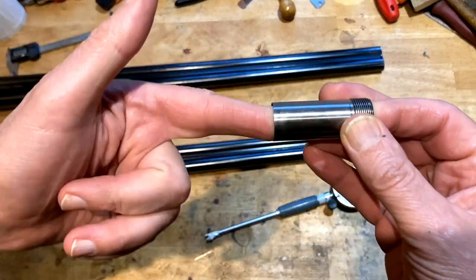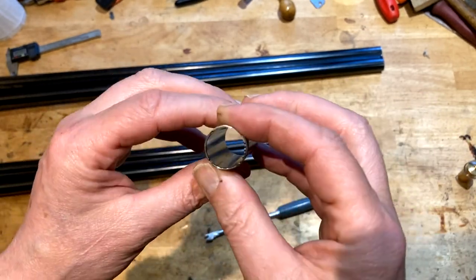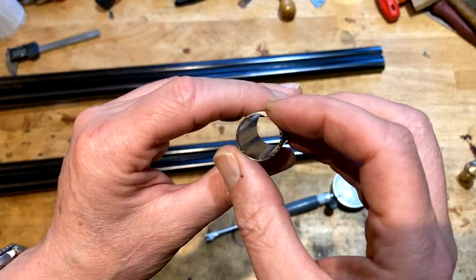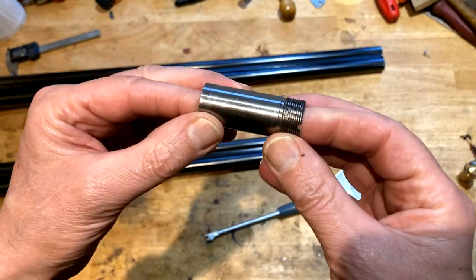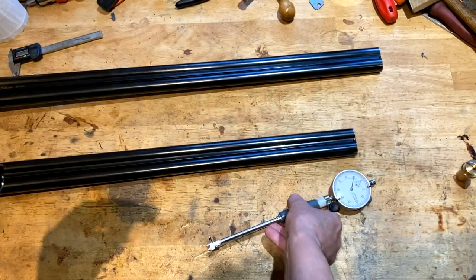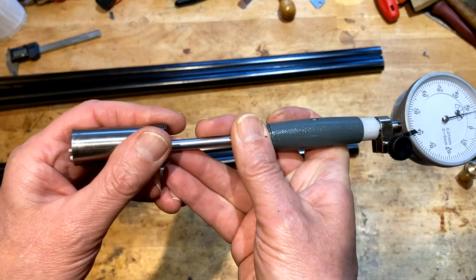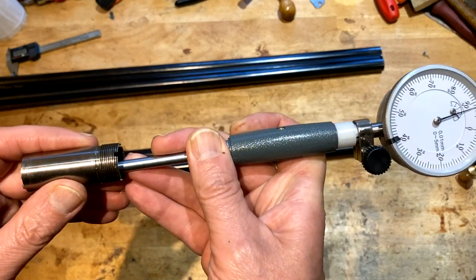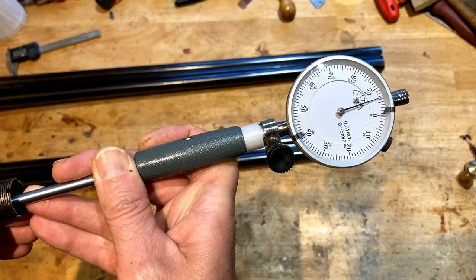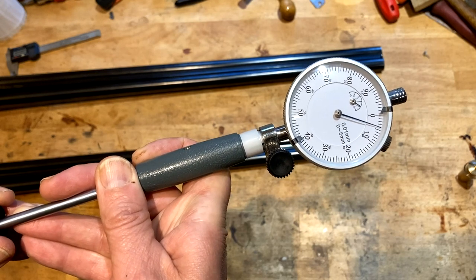that is approximately bore or cylinder. And it thickens. It starts off very thin and it thickens up by way of a ramp in there, which I can probably show you with the bore gauge. We start there. It's a nadgers off, but it steadily increases until it flattens out.